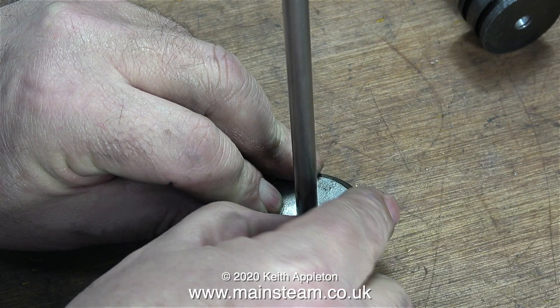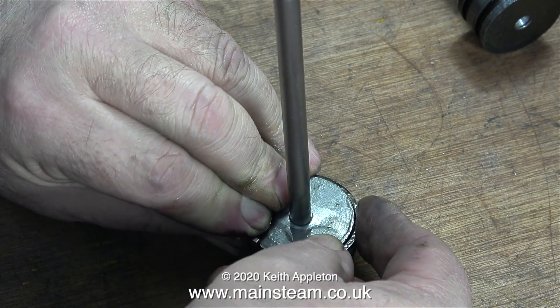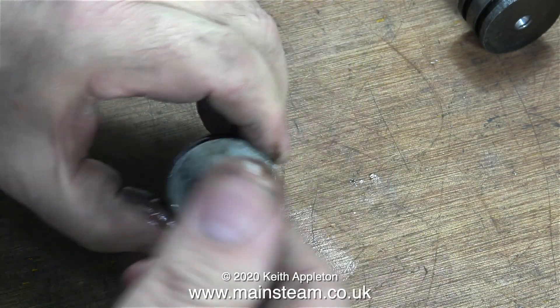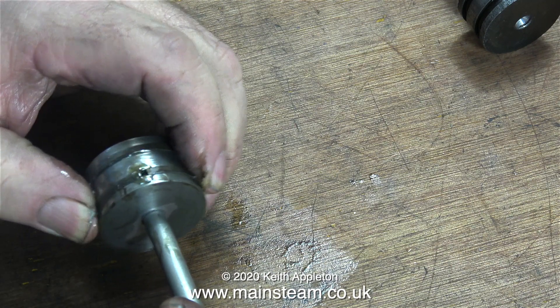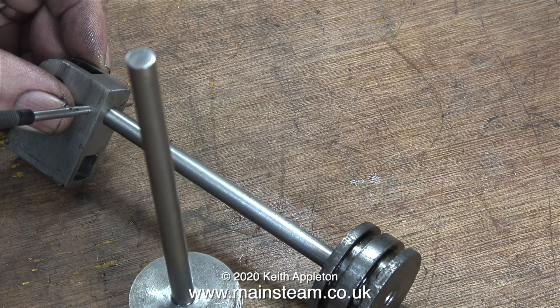Back to the story about making things three times. My first attempt at marking out was a failure. My second attempt was okay — I drilled and reamed the holes to the correct size for the bushes, finished the connecting rod, and everything was good, until I drilled the oil hole in the big end. The drill wandered and broke, making a mess of it — scrap number two. I finally got it right the third time.